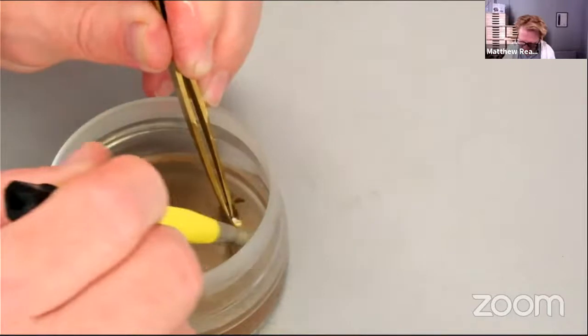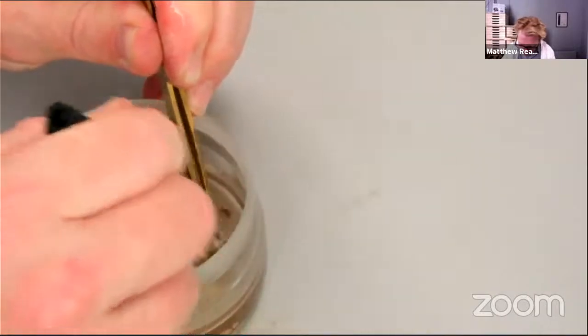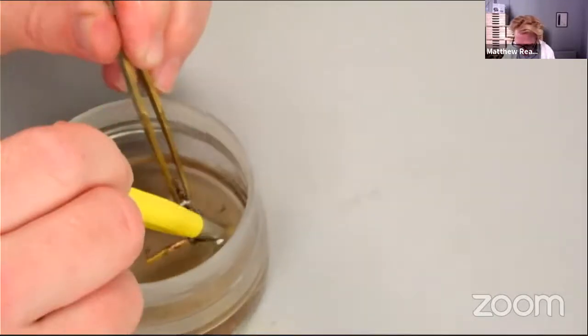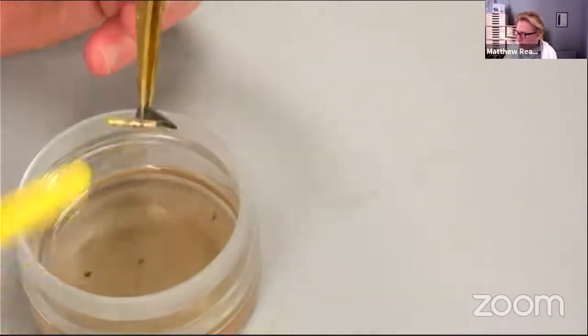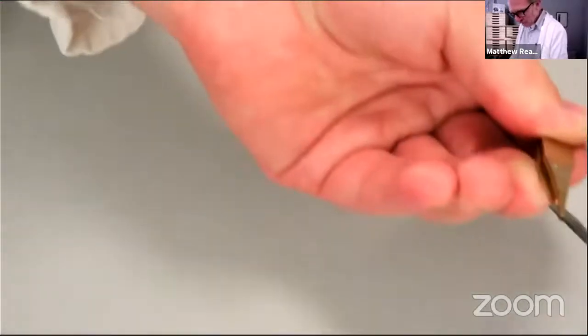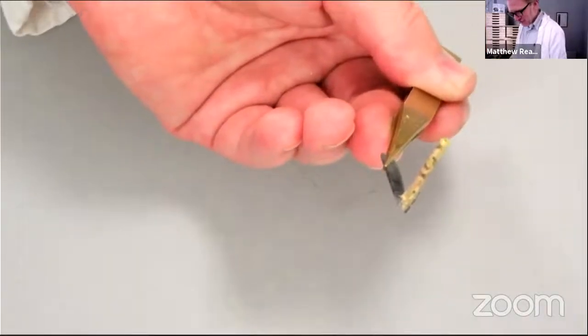So this kind of cleaning's a little bit brutal, really, compared to what I would normally do. But as I say, given that we've just hard soldered the thing, it's less brutal than throwing it away, that's for sure. White vinegar. Experiment, he said rather cheekily, smiling. Don't ask me where I got it from. Is it white vinegar out of the cooking? It may be. It's going to go and rinse off the vinegar. I just thought it might be useful to get rid of the flux, and it seems to have done a good job. As you can see, it's really sort of cleaned up the brass. So just a bit of an experiment. Go wash, give it a rinse.